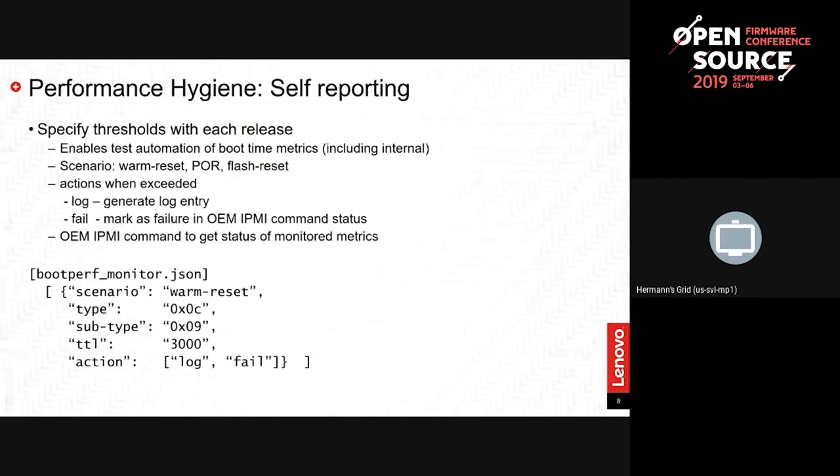Q: Do I need to have that library included in every phase of boot? A: Yes. In one of our implementations it's a very thin header file. You could implement it as a library and would have to have it in every phase of boot. Our implementation uses a pound-include that determines whether it's being built for u-boot, for the kernel, or for user space — so it's the same source file.